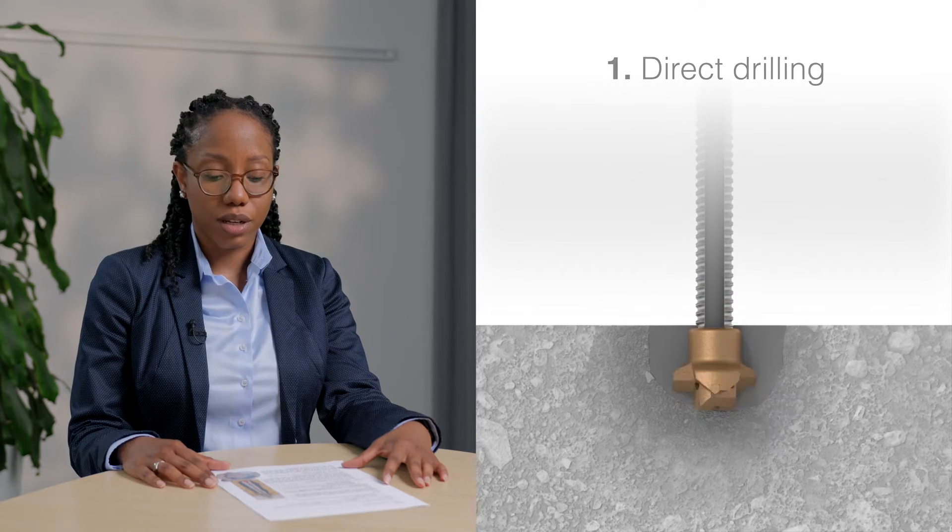This flushing fluid fills the borehole and stabilizes it against collapse while transporting excess soil particles up and out of the borehole. Particularly in granular material, this method of installation creates a rough and uneven interlocking interface along the grout-ground surface, thus increasing the skin friction.